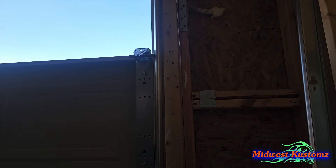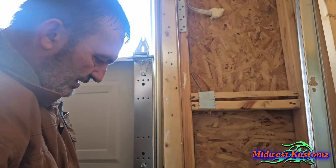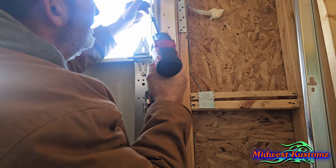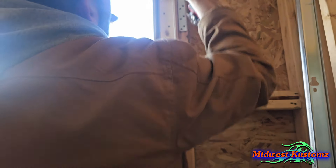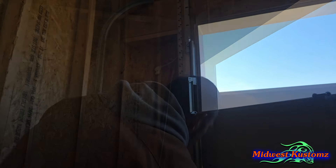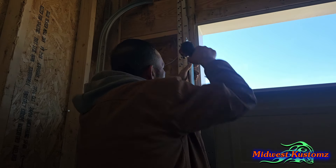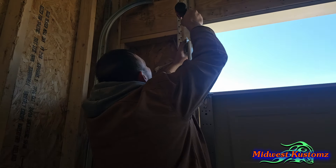I check the distance in my wheels again. Make sure they're out just a little bit — a little over a quarter of an inch. Use the bottom slot. On these I make sure the bracket is going out toward the top just a hair, so when I put my spring in I'm not fighting it. Make sure these are flipped down because when you put your panel up you'll have a problem. Make sure all these are good — bring them out just a hair, about a little over a quarter inch, then tap out just a hair. Not much.